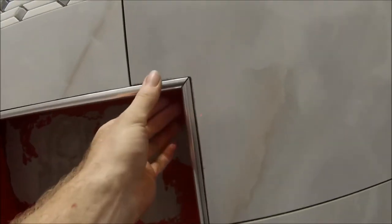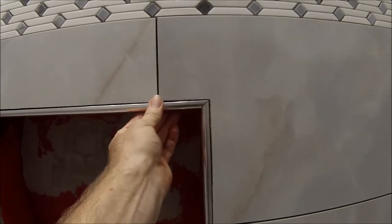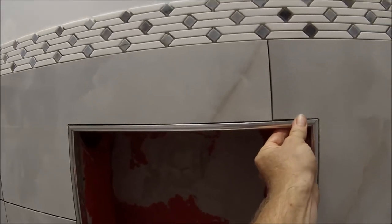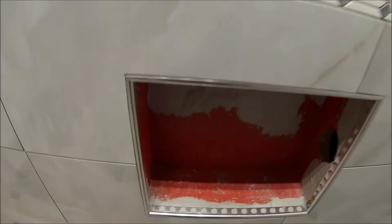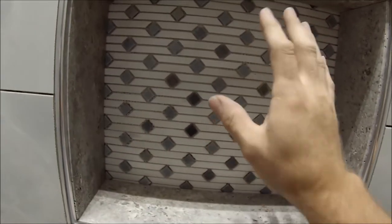I put in a little niche with Schluter trim and the corners are pretty good at 45 degrees — this is a little off, but if I pull it down a little bit it'll be fine. I can remember when I put the thinset to push this down a little bit and it should be good. Just finished cutting my tile here — I already laid this one with pre-mixed thinset and now I'm going to mix up some rapid set thinset for the natural stone. I cut the width a little wider and have pieces laid in on the sides — looking really good.